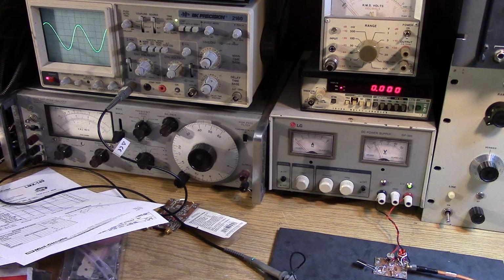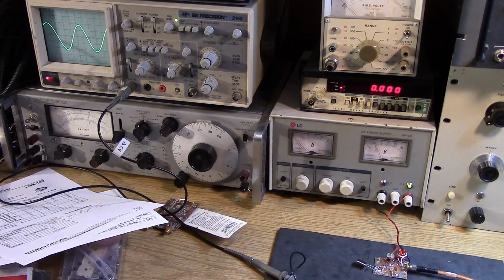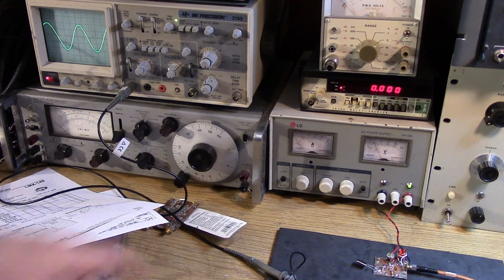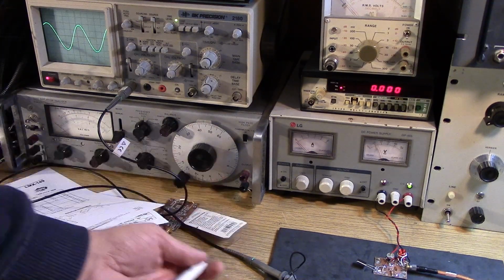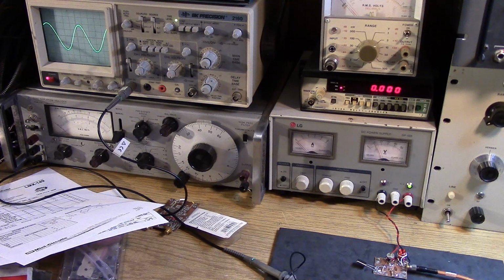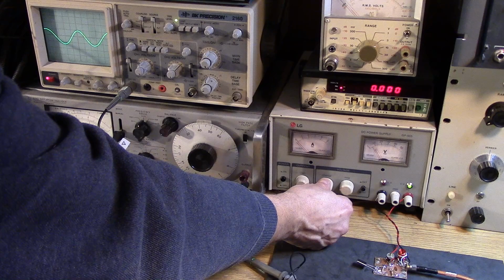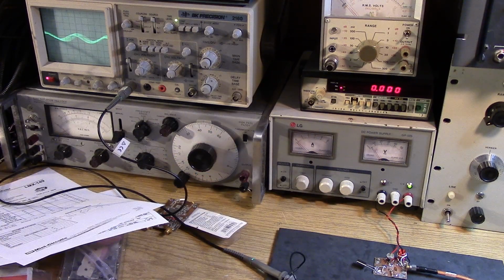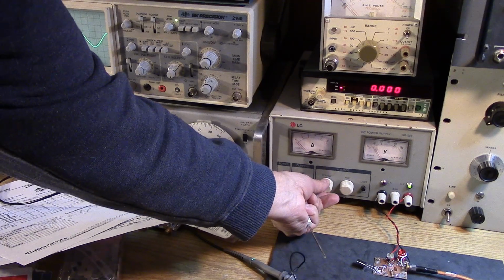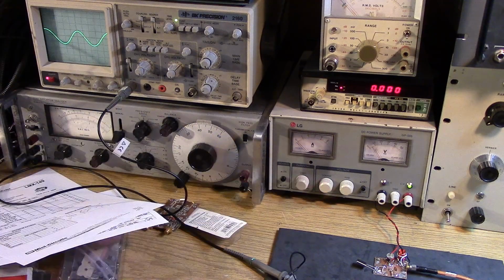So what I did is I redid the circuit. Very simple field effect transistor oscillator, not much to it. And it's working very well at 12 volts, putting out a beautiful sine wave. Fewer parts. Okay, we like the FET. But let's reduce the voltage. And it starts to get squirrely. You know, the bipolar was pretty happy down around 5 volts, but the FET not so much.